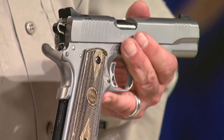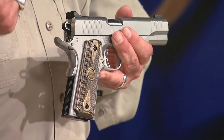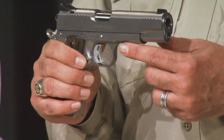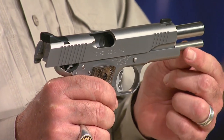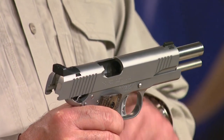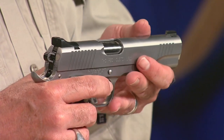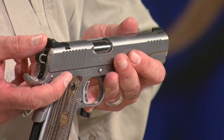We've tried to take this gun and create a fully capable combat pistol out of stainless steel. We have incorporated some of the same features we've learned on the GI gun, like a hardened disconnector and sear and a one-piece barrel, but this barrel is stainless steel along with the slide and frame. We use a high-grade 416R stainless steel and incorporate a full-length recoil spring guide, along with features you'll find on other high-speed guns, like a dovetail front sight and a rear sight that is dovetailed, extending the sight radius to the full five inches.